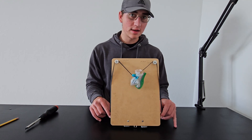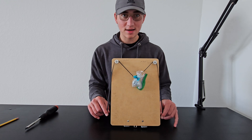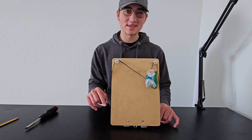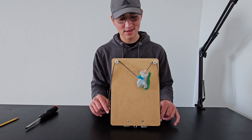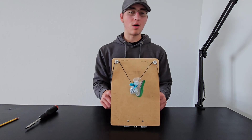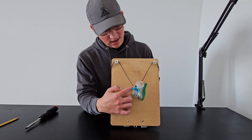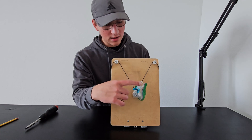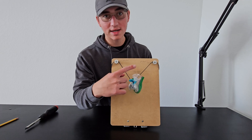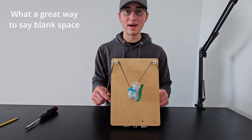And if I want to move it up, I just do the opposite. If I want to move it to the right, all I have to do is move the right motor a little bit outward and move the left motor a lot inward. Obviously my jank setup is not too convenient for this, but you get the idea. We can essentially move this gondola anywhere we want on the board. And all we have to do then is toss a servo motor on the gondola itself, so anytime we want to pick it off the board, we just have to actuate that servo motor, move it to wherever we want, and then put it back down. That way we can make parts in our drawing that don't have anything on it.